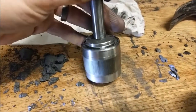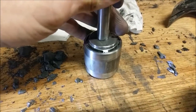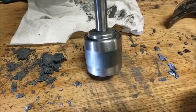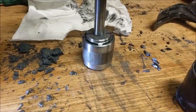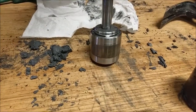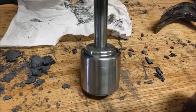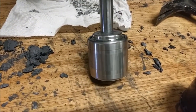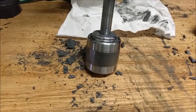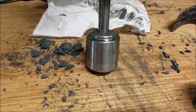This guy was possibly offset, tilted — most likely offset somehow when it was riding, so maybe it's a concentricity issue. You've got excessive wear on one side of the piston. And then when I rotate it around 180 degrees — nice, polished piston. So you just do a 180 and that mimics what I'm seeing on that seal at the top of the strut that started leaking. So that all makes sense.